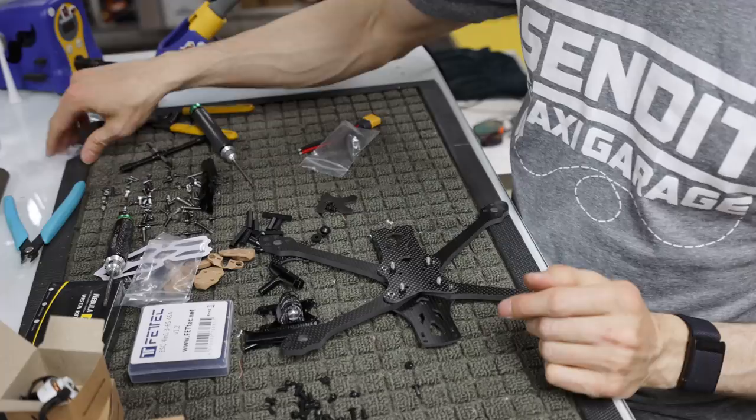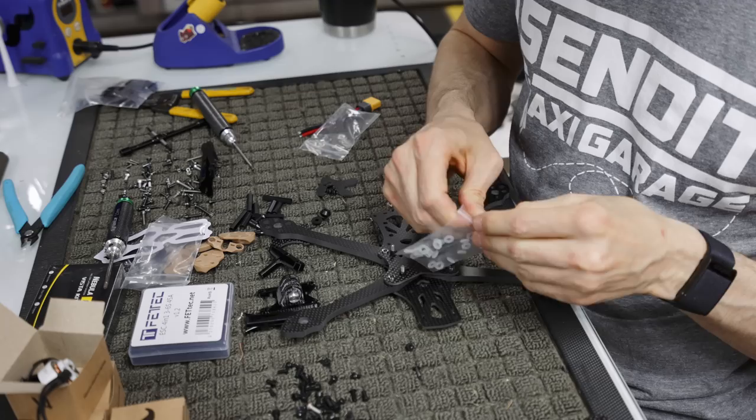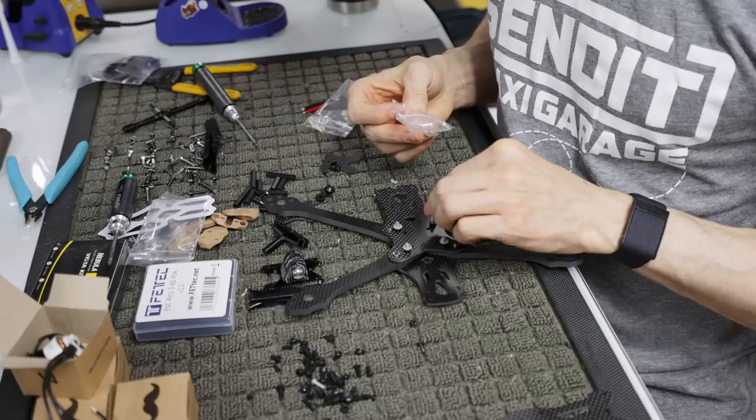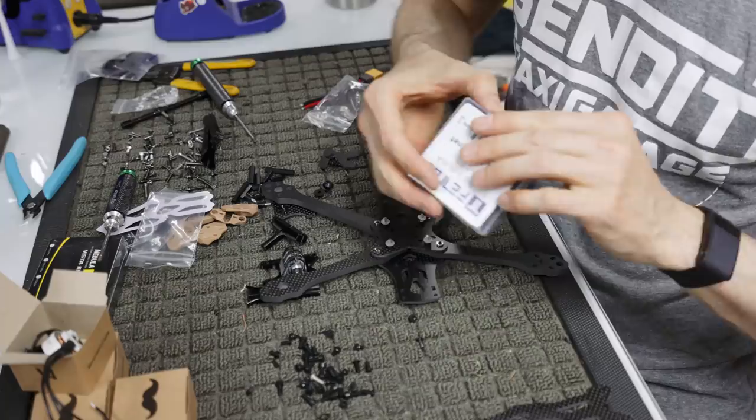So the next thing I'm going to do, I buy these on Amazon. I'll put a link in the description below. They're little gummies that go underneath the ESC. And all I do is slip one of those over this little center section, and slip those over there. All this does is isolate the ESC from the frame. Nothing crazy, but it's going to give you a little bit of added protection.